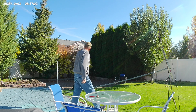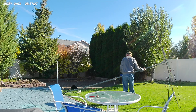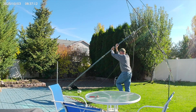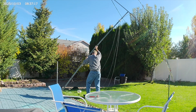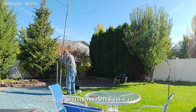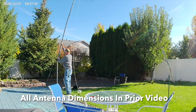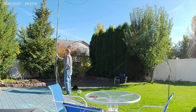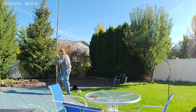The antenna weighs just a little over six pounds, and the fiberglass mast doesn't add a whole lot of weight, so it's quite easy to get this antenna up about 17 feet in an HOA environment. I usually take it down during windy weather, but I have left it up during some contests while it's been quite windy, and it's worked out very well. I just use the Armstrong method to move it to the correct bearing.